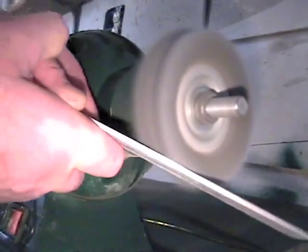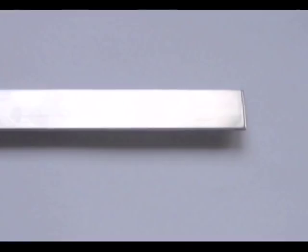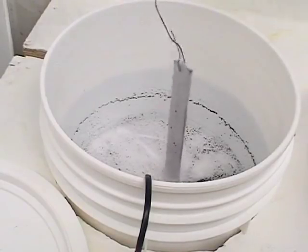A smooth satin finish is the ideal base for dyed anodize. This finish is very easy to achieve using bead blasting or the scrubber wheel. However, by buffing the aluminum, the anodized part will have a shinier look to it. Of course, if you do this, you will need to use the SP degreaser to remove the buffing compound.